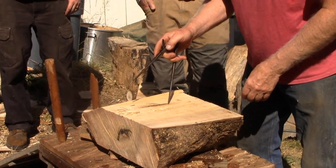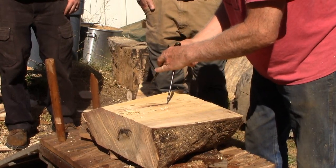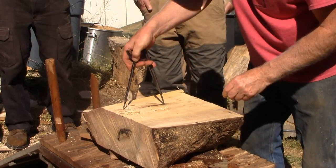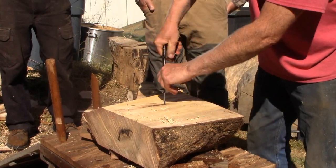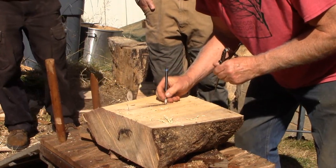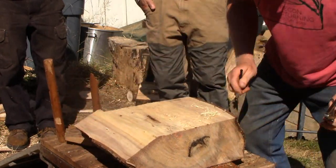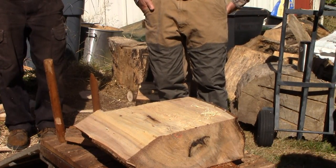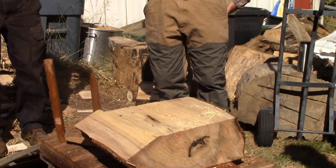Here, let's start. We got less heartwood here, so let's do a smaller bowl just for fun. I want to see if I can get rid of that rotten spot. Looks to me like the rotten spot goes right through the pith there. It could do that. That may be an old branch that broke off, and the bark inclusion went down through it. So I'm just going to trim this end off just to see if we got rid of that. I don't know if we did or not, but...